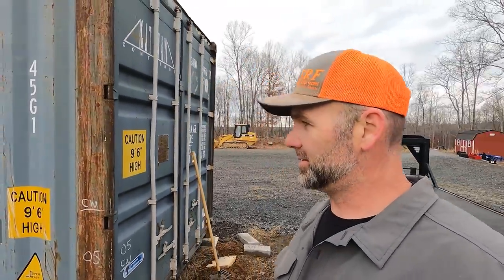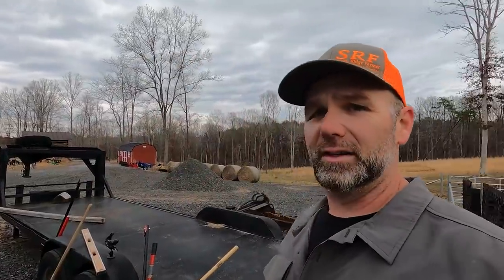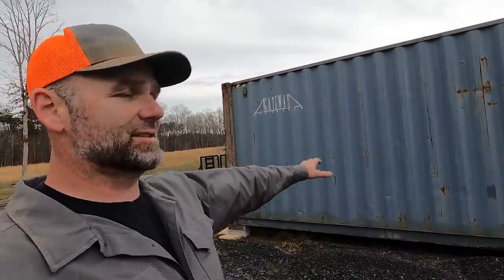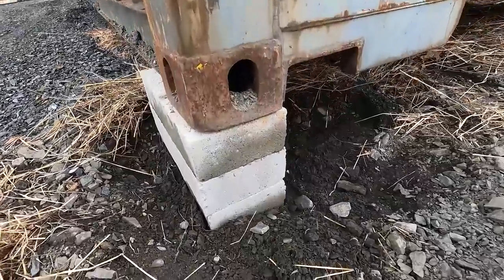These things happen. Only took me about an hour to get this done. With a shipping container like this, you don't want it to be twisted — when it's tweaked slightly the doors will not open properly. What I ended up doing was two blocks on the upper side and three blocks on the lower side. I wanted a slight slope towards the door so that if it ever springs a leak, water rolls out the front. You can see triple stacked right here, double stacked here, with a two-inch cap block underneath the six-inch. Didn't bust any blocks.